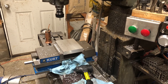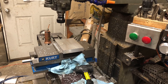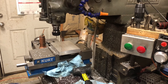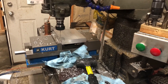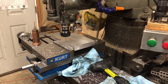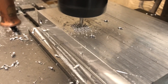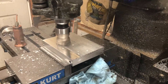It's a 2D adaptive clearing strategy because we didn't have an end mill the size we wanted to make these holes. So we're going down in, helixing in at 2 degrees, and then cutting the hole to size. We're glad to have a mill back — we just about forgot how to run it. It's pretty interesting getting it back to the front for us. We're still going in there kind of nice and slow. We're going to show you when we get to facing this off just a little.